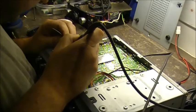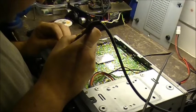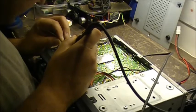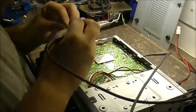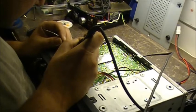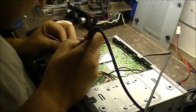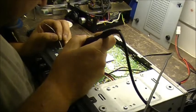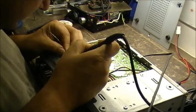Solder joint, gotta get the solder joints. Every solder joint here now is getting a smack. I have to say some of the soldering here from Cherokee is not all that great, I have to admit. Traces have solder, yes, but not the greatest. Reapplying new solder to fix that right now, because it don't take much sometimes, folks. Sometimes it don't take much.